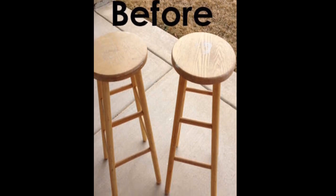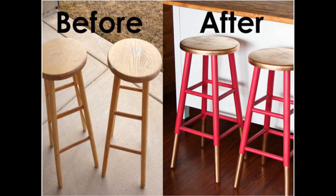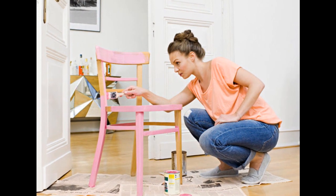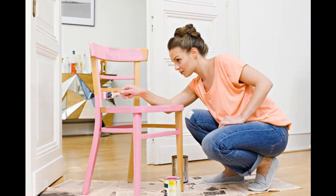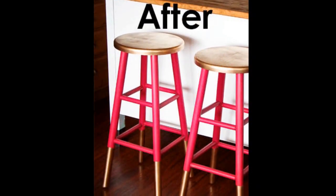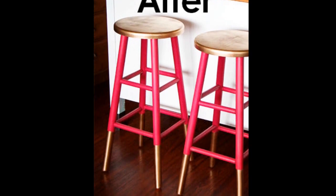If you can't paint your walls, add some color to your furniture. If you don't want to paint your entire piece, you can always accent parts with either spray paint or regular paint. When painting wooden furniture, make sure to: 1. Clean off any residue, 2. Sand everything down, 3. Prime it, 4. Paint at least 2 coats with a foam roller, and 5. Protect it.